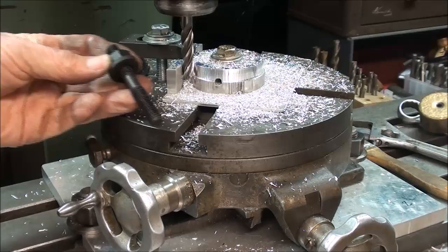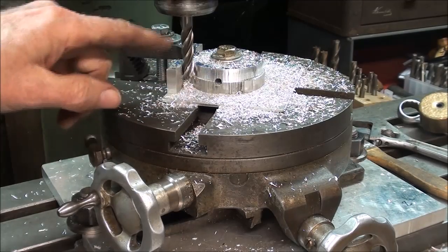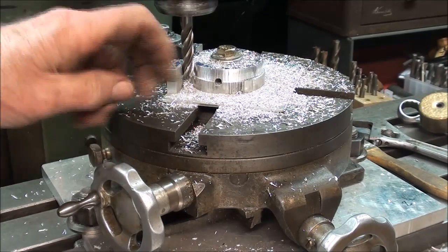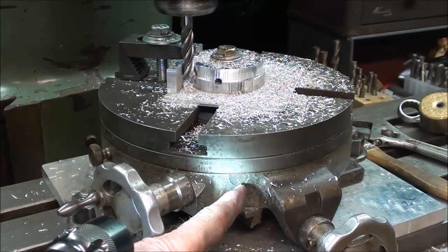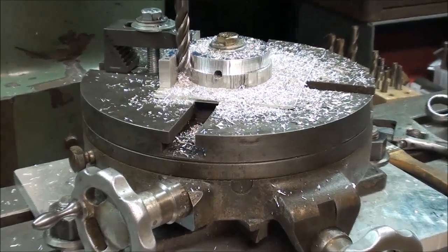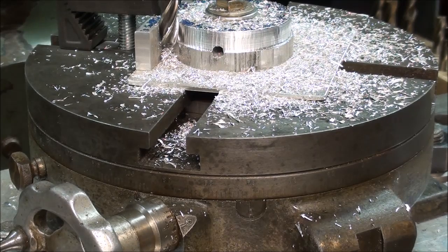I suspect I will be conventional milling because there's always play — can you see that play? Climb milling will sometimes take up that lost motion and can break the cutter or ruin the finish. Just as I predicted, the stud was too long so I replaced it with a cap screw. Now when I get back into the corner, as I get closer to my dimension, rather than using a stop I can go by degrees on the zero mark on both ends. I'm only down halfway, and as I predicted I'm getting a rough cut with climb milling, but the finish cut where I'm only going to take off about a thousandth should improve the finish.